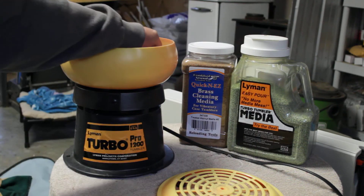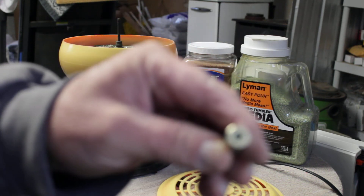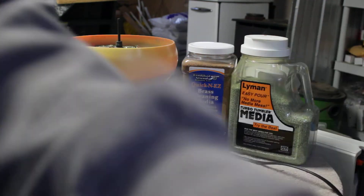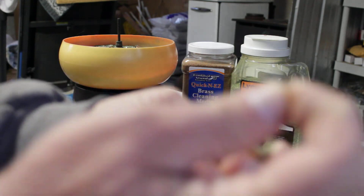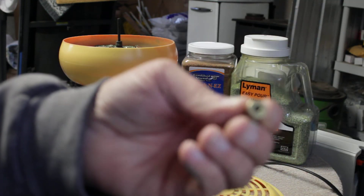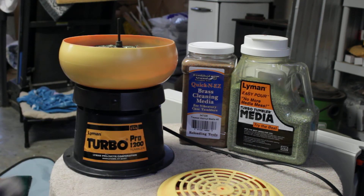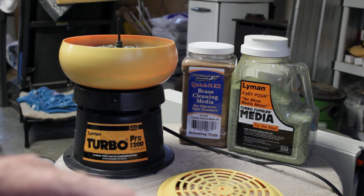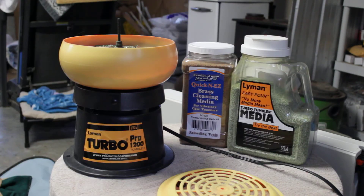This one doesn't have anything — it's hard to see. But my camera won't even focus. There is media stuck inside that primer hole and you can smack it and everything else, but that will not come out unless you get a sharp instrument and go in there and poke it out. So my really quick tip on the tumbler is: deprime your brass after you have tumbled it, or you're going to be sitting there with a little sharp object trying to clear out that primer hole.